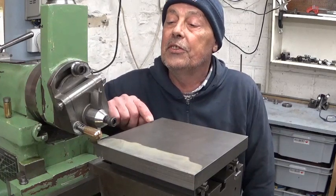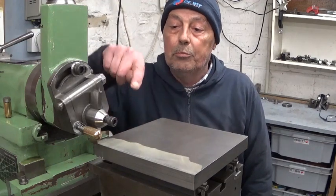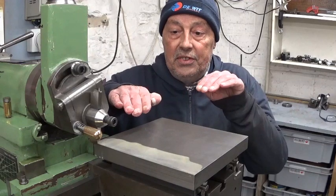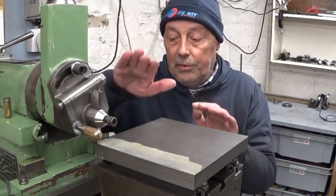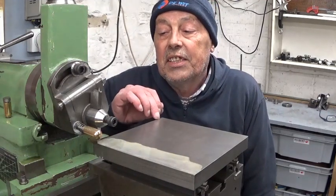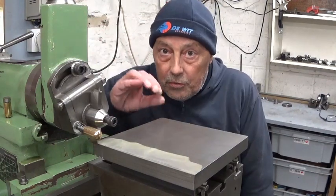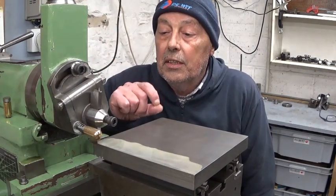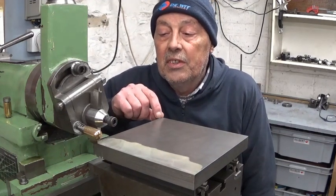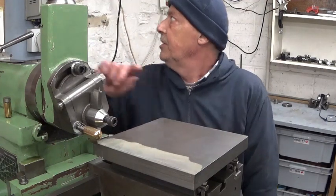First a roughing cut, about 1/10 of a millimeter. It will be a little bit more this side than this side, because I don't know why, but the part is a bit out of alignment, but that's okay. And then a second pass, a finishing pass, I'm gonna dial in about nothing, really a little bit. So two passes, two times more than 40 minutes. I'm gonna be here for a while, so let's go for it.